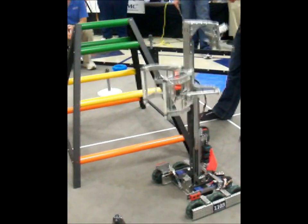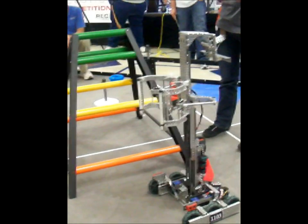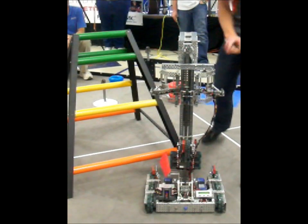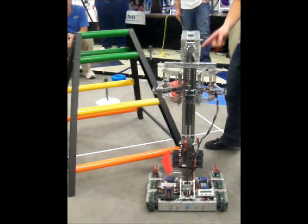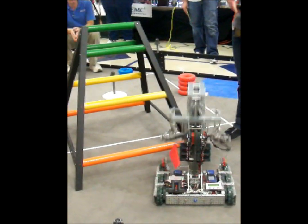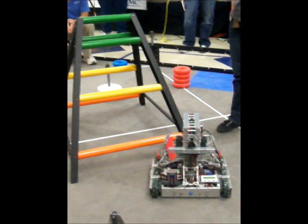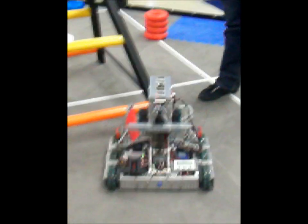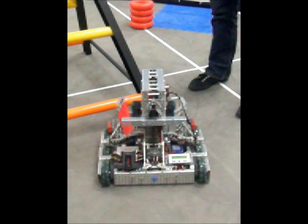I went with this double-extending tier, and instead of the more popular rack-and-pinion tiers, I decided to go with high-strength sprocket and chains. This chain interlaces through the different tiers and is attached to the top one; the middle tier is independent. I wanted it as strong as possible and able to configure gear ratios based on available power.